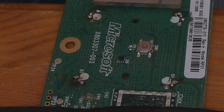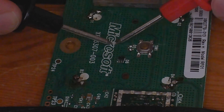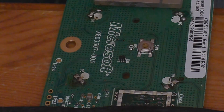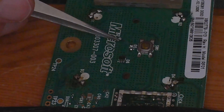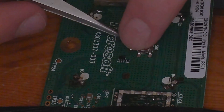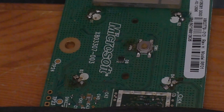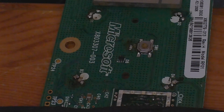So I'll set this on my multimeter and take my two contacts and touch them to the LED. Not getting any light, so they're the wrong way around. Try that - now you can see the LED is turned on and it's blue. So I know it's the blue LED I want. It's always a handy thing to check just in case you get mixed up on your colors. So let's put it in position with the T facing that way - try and move it into position. There we go. Next we need to clean up the flux and we should be all set to test our LEDs out.